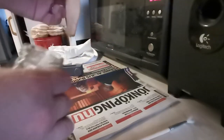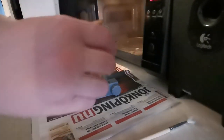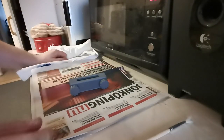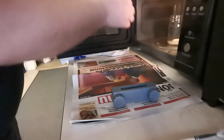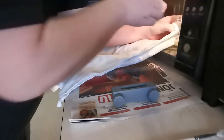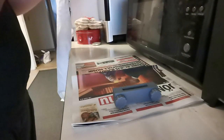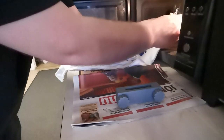The softbait material is around 180 degrees when you pour it in. You can buy Plastisol and heat that up and use it, but I tried here to just remelt an old softbait I had and it seems to work. I heat it up in the microwave — I think I heated it a little bit too much because it changed color to a brownish tint.